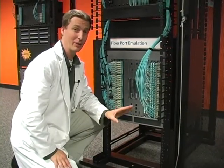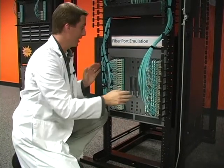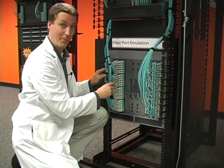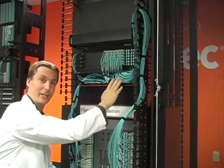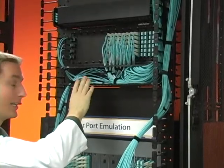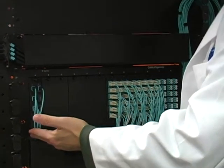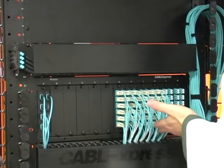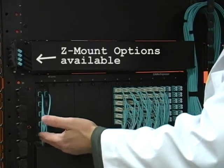Here's a great example of how it works. Here's 48 ports cabled up the traditional way with fiber jumpers. Here we have 96 ports — double the density — with the Skinny Trunk Harness. Look at this: on one hand, you have a cable management nightmare with the jumpers. Over here, cable is significantly reduced and that's easily manageable. And then look at this: with the Skinny Trunk Harness, you use very little space in your patch panel versus over here — 48 ports using a lot of your conditioned space. 96 ports using very little of your space.